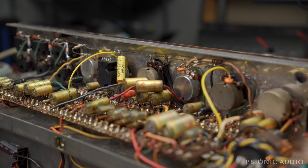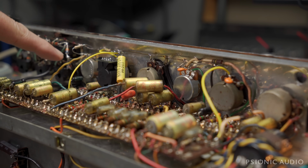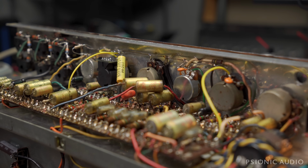Never liked that song, but there it is. Anyway, this has a 750K resistor here, limiting the max speed because the speed pot, as I mentioned, is not as large as it was supposed to be by about 700K. So once I get a pot that actually measures 3 meg, I can decrease that 750K. I'll probably go down to the stock JMI max speed of 330K. And then you'll have from 330K to 3 meg, and that'll be a nice range.